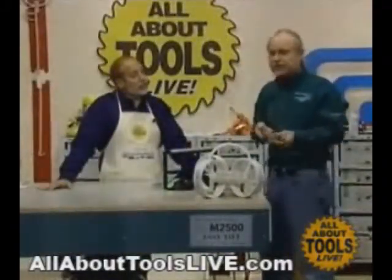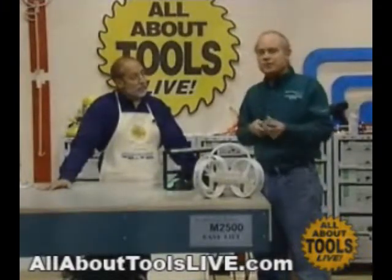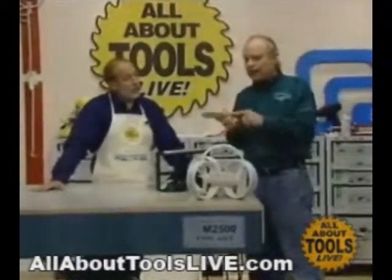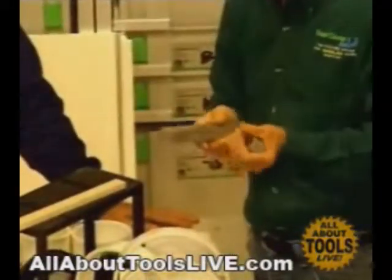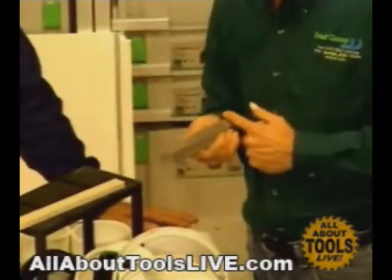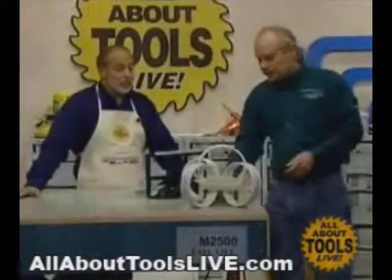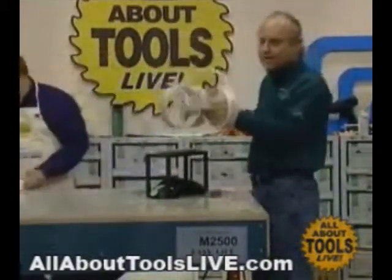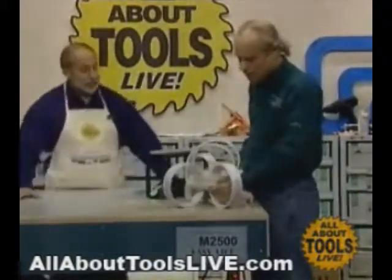There's an advantage to this because you don't have to worry about how thick your substrate is. Whatever substrate you buy, you can cut your front edge. The other thing is you're going to have a factory finish as your front edge, so all you have to router off is a half-inch deck instead of a full one-inch of material. This is basically how you can do it — you can make up your own boxes, as long as it's flat and level.